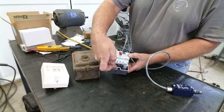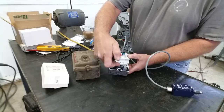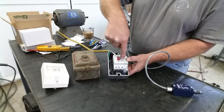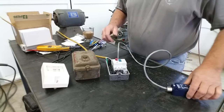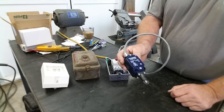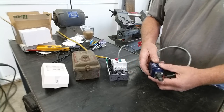we brought a wire in from the secondary side here, which turns this into a collapsible circuit. It's going to be self-collapsing, and brought it around and powered up the shunt here only when our button's pressed. So when our button's pressed right here, we've applied 110 volt power to it, and then we run the neutral out. You could run the hot wire out if you like. I'm going to run the neutral out and back. That way, if it gets wet, there's never any chance of anyone getting shocked.